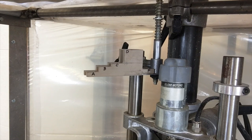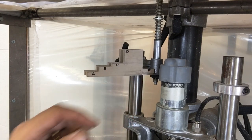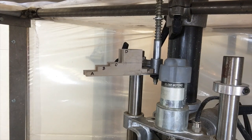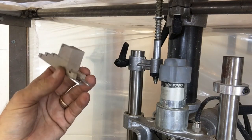And that way I just systematically go through my work instruction and set the pin to the pin height that's called for, and then the depth to the cutting depth, and it makes it foolproof, because otherwise you can blow up a pattern by getting confused and setting the depth at the wrong depth of cut. But this makes it a lot easier on complicated parts. On simple parts where there's only one or two adjustments, I don't usually mess around with making a key. But on more complicated ones like this, a key can be pretty useful.